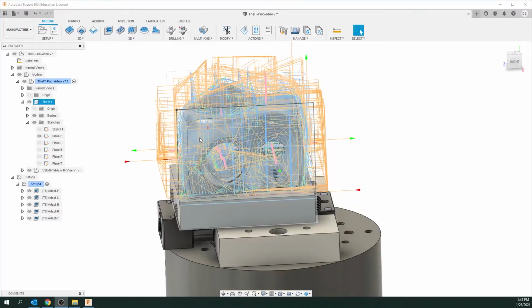Okay, so we've done all 5 sides of this now. You could save these individual G codes now, but I like to go through all the operations. Just so you know, the operations I've done so far are probably a few days. When we get into the finishing, it's going to take even longer. The Pocket NC is not a speedy machine.